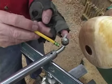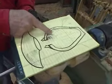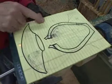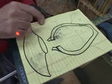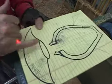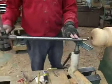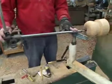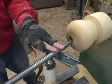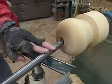But this is really amazing. If I'm using a shape like this and I want to get up and undercut the shoulder and get up into those most traditional rounded bulbous shapes, I'll be able to reach with that little bend of a swivel assembly and still maintain a very small mouth opening. I'm going to thread it in the hole and get around. I'm going to swing my handle over so that I can undercut a shoulder and get up under here. And now I can cut inside.